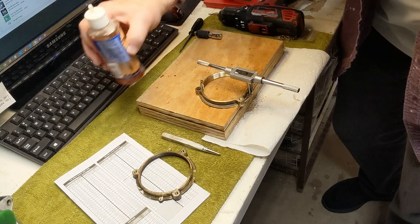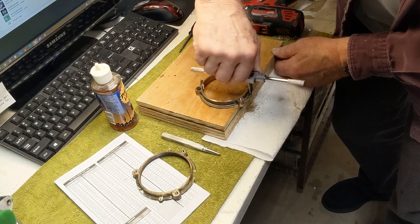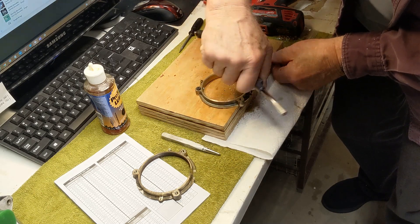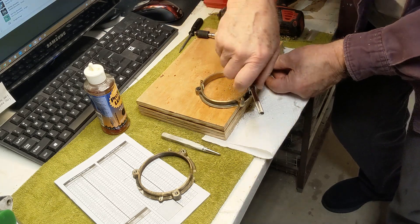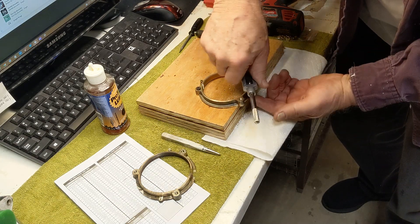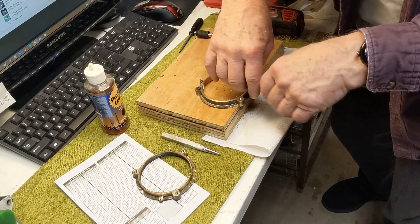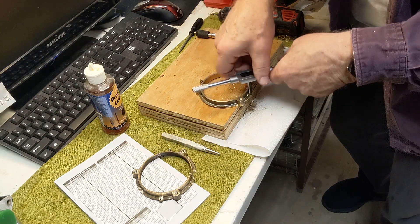It's starting to make a little noise again — a little bit more cutting oil in here. It's making a noise but it's really slippery, moving really well. We're almost through — I just felt underneath on the bottom and it is through. There we go — it turns nice and freely. Now I'll undo it, and we've got to watch it when it gets to the top so it doesn't fall out and damage the threads. I can start the bottom threads just fine.